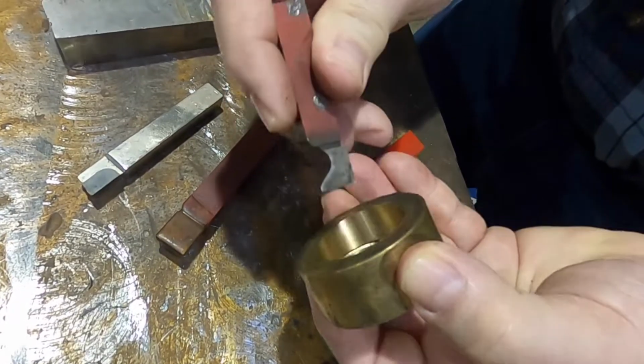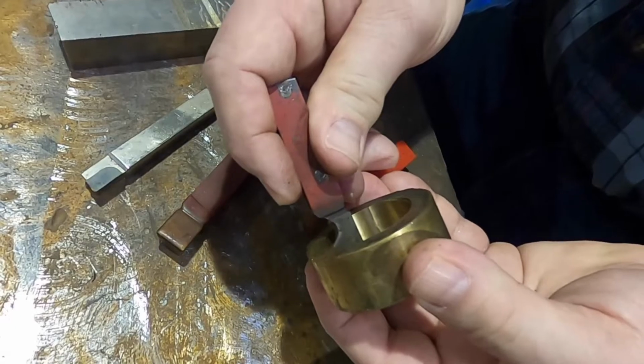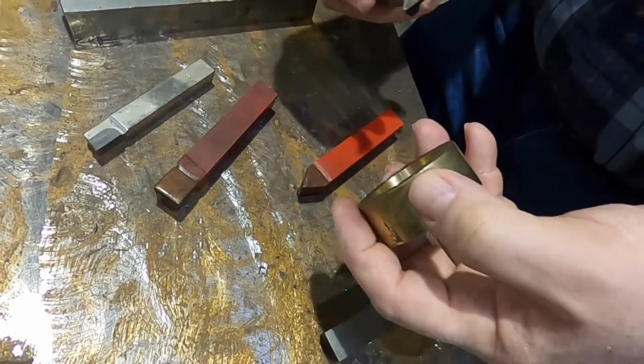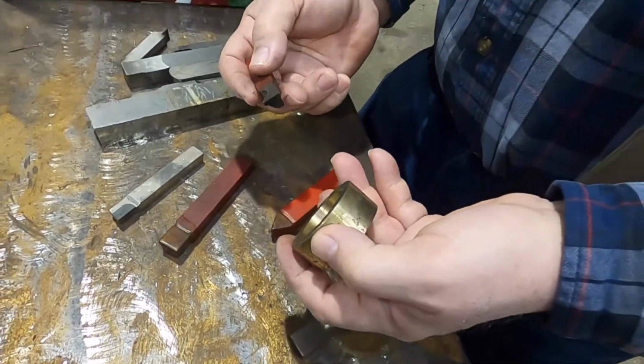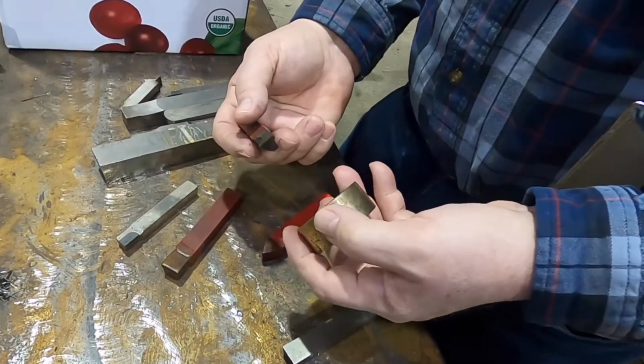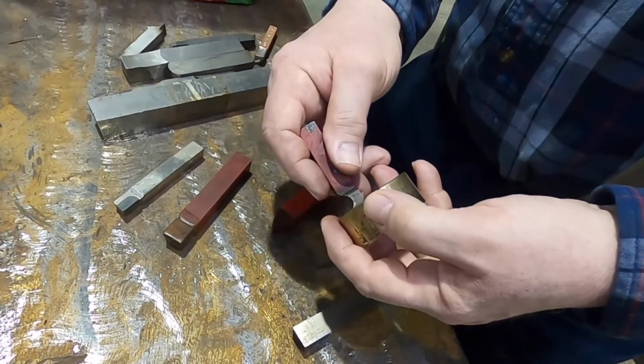And you go in here, you notice it'll make a little bit of a flat where the snap ring groove goes in, and it has a taper to this side so that you can start putting it in and it'll just go in all the way. Now that doesn't make it as strong of a taper. It's more likely to move on this side, but sometimes you want that depending on what you're putting together.